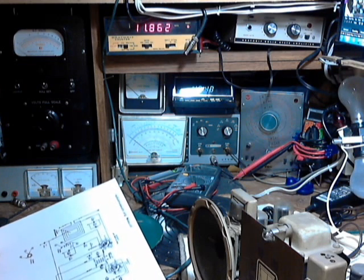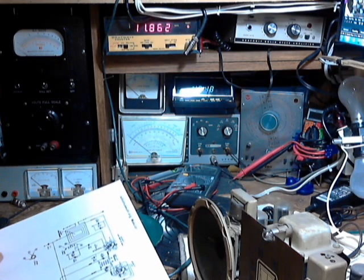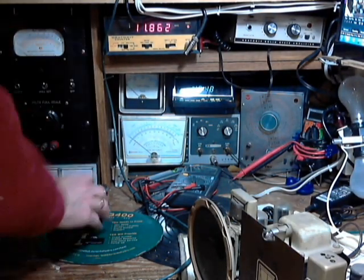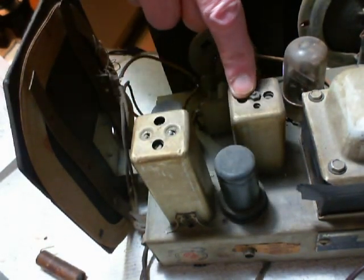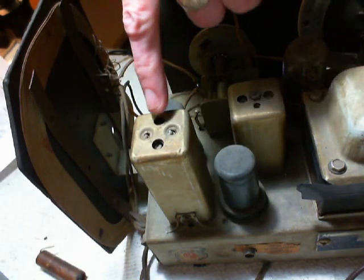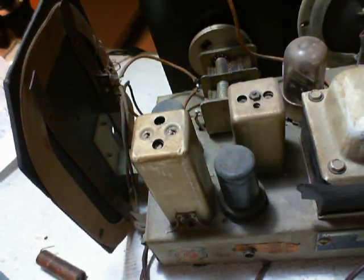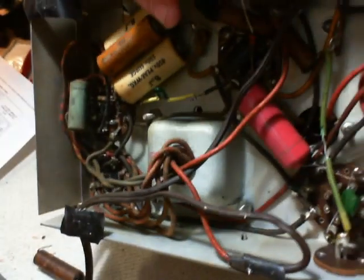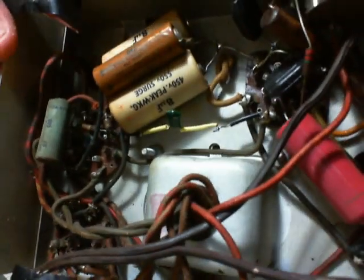It's just two IF coils. Although I think I'm seeing another one right on the circuit diagram here. Let's take a closer look and see if we can find something more in this radio. So I see these two obvious IF cans and they have access to trimmer screws, two of them. So there shouldn't be anything from underneath to do. But let's take a look and see what we got here. I don't see any adjustments whatsoever.